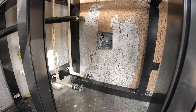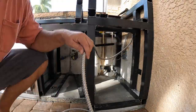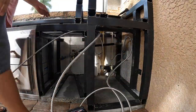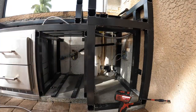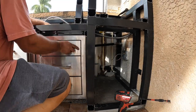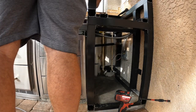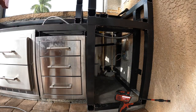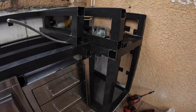I am going to have it professionally finished — I just pre-wired it. The way this will be wired: everything will come out of the wall and into one single 20-amp GFI, which then will power the rest of the kitchen. If anything shorts out, it'll pop that GFI and you'll just have to reset it by reaching under the sink. I figured that was the safest way to wire everything so that if there was a problem, it was just one GFI.